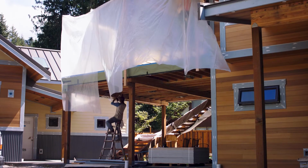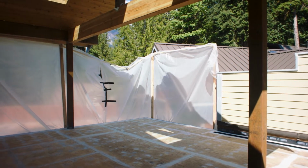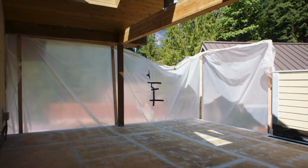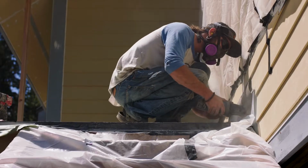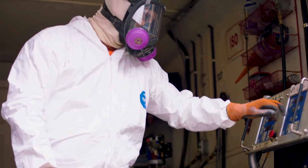The beautiful thing about our spray applied waterproof membrane called Polyurea is that it is seamless and monolithic. It can be sprayed on a multitude of different substrates: plywood, concrete, steel, PVC. When we are on a job site like this, most of the time what we have is a deck that is made of plywood. The first step is we come onto the substrate, the deck, and we sand, we bondo, and we hang our flashing, and we prime. Once the primer's cured, we come back and we spray the Polyurea.